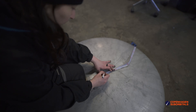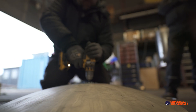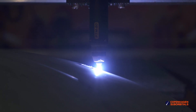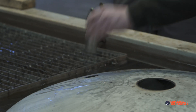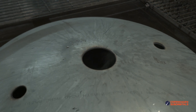And if they are, then we also have a few bulkheads nearly ready to go. Continuing from the previous week, Bianca, Jakob and Thomas worked on measuring out and cutting piping holes for them. The automatic torch height controller on the plasma cutter continued working perfectly while cutting out a slope, and this time we set the cutting file right, so all the holes turned out the size that we needed. All three remaining bulkheads were cut, so going forward we'll start welding clamp fittings to them.